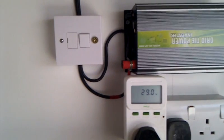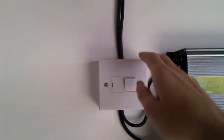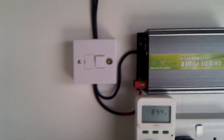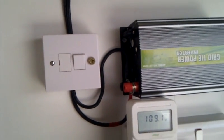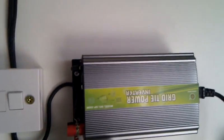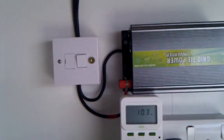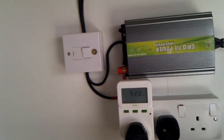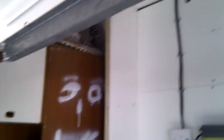I'm going to get a separate meter, just like we've got in the shed, or just an analog amp meter, so I can measure it. I can't use my volt meter because that's only rated at 10 amps. If this thing's pushing out anything more than 100 watts, it's just going to blow my meter — if it's pushing out 114, 115 watts, even if it was 100% efficient, that's still more than 10 amps through these cables, which is obviously not 100% efficient. Long-term plan is my dad wants to buy two new panels every month, so 160 watts every month, until we get to 1,000 watts worth of power.